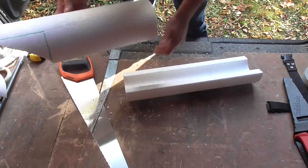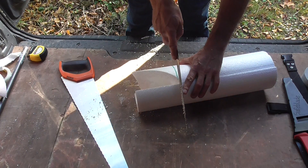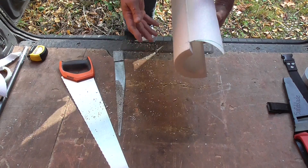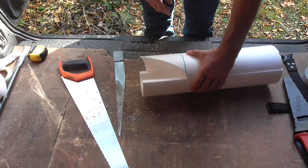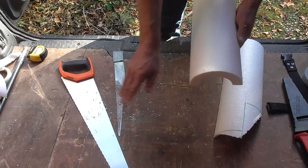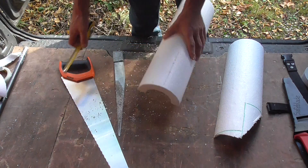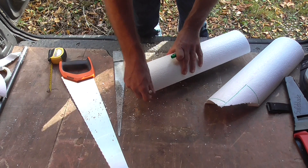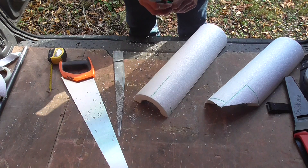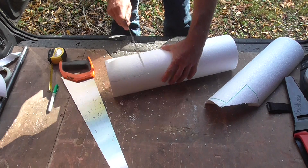So there we go — we know it's now 45 degrees. What we do now is put the other half together like this. I put a mark in there, scratch that through there and put a mark in there. Doing it this way means you won't accidentally cut the same piece twice. So what we've got here is our diameters going in there, our wall thickness going in there, and all we need to do is put a centre line in there. We get the centre line in and I mark them in marker pen so you can see exactly what's going in — just marking in our centre line.